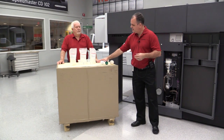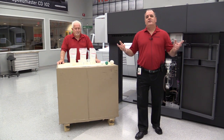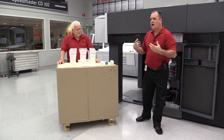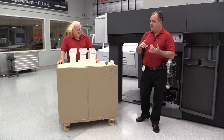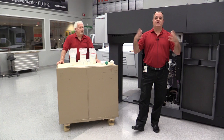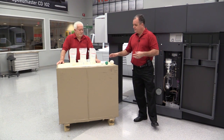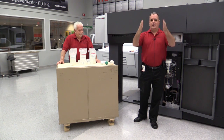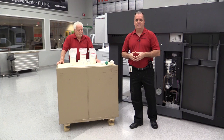The reason why is you want that sheet to lay smoothly, and when you're doing work and turn work, it's going to have less set off because that sheet is going to be smoother. And the reason why we look at micron size is we look at it as a blend of tapioca, potato, and corn making our starch. And as those are blended together, that's how you get different sizes. It's actually a distribution curve, and where we stand in the center of that distribution curve is what the powder size is.